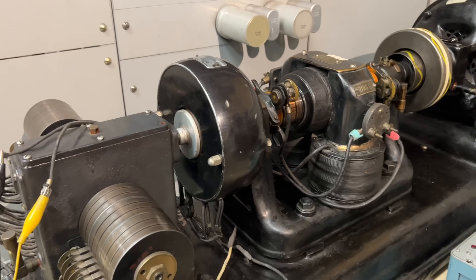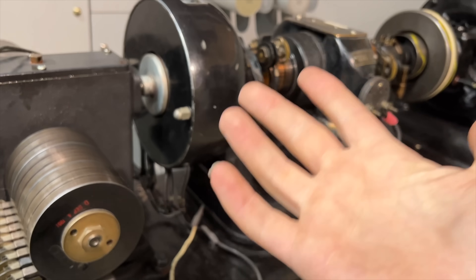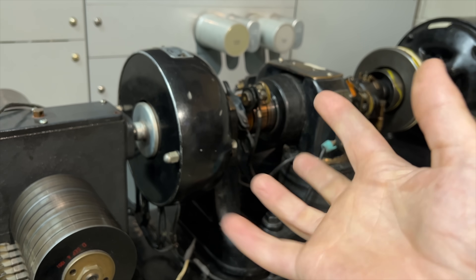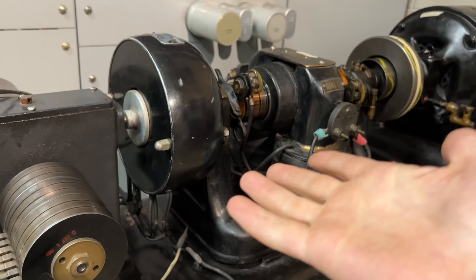But I checked the BSP and it showed a picture of this resistor — a special field excitation current-limiting resistor. And I was like, oh no, do we have that? The reason I was curious about that resistor is that the BSP and the schematic don't give values for it. They just say it was set at the factory, and if you need a new one, contact the factory. Because apparently each of these field windings is slightly different and each resistor is set to accommodate those field windings.